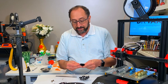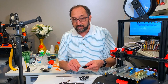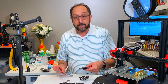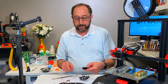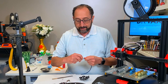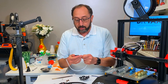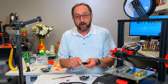Now, if I were to leave it there and assemble this back together, that means I would have a gap between the end of my Bowden tube and the nozzle of about five millimeters. In all likelihood, my printer would jam repeatedly. If I look at the tubing that came with the printer and measure it, it's a little bit thinner, and in fact that tubing will fit all the way through. So I have the tubing through the coupler, which will then go through the radiator mechanism.